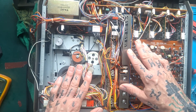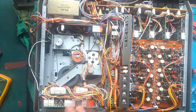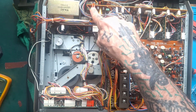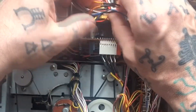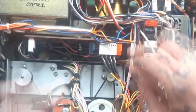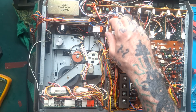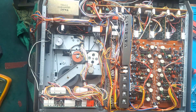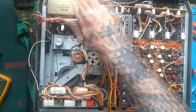On later iterations of the Portastudio, which is mostly split into two boards, you would only have one 12 volt regulator for the positive side of the op amp swing. Anyway, after fixing that I'm still getting absolutely nothing from that winding of the transformer — no voltage at all — so in addition to blowing the two caps, the transformer had actually died. You can see from various wires mended with shrink wrap that I've put in a spare transformer. Cutting them in the middle and fixing with shrink wrap is easier than completely removing the board given all the other connections — less work and less billable hours for the customer. The counter now works fine, so I'm going to assume the counter problem was caused by the transformer in its death throes.